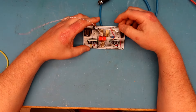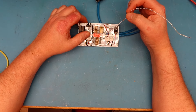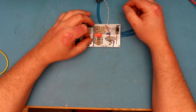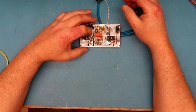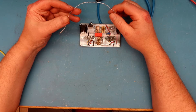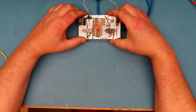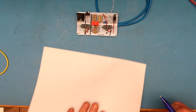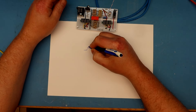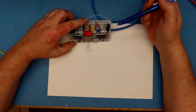Here is my power supply tester. I remember making it and basically how it works, but I've done some strange things to it. I was not able to get the voltmeter for the AC to be very accurate — I just used a rectifying bridge and a small capacitor, and it's a bit inaccurate. It works by switching in a load, which consists of lots of resistors piggybacked together in parallel to handle more power dissipation.